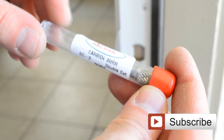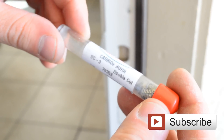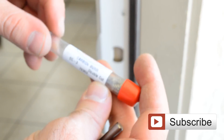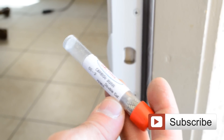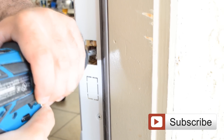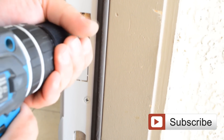Now we're going to use a small tool I bought at a local hardware store — they don't sell it at Home Depot. It's called a carbide double-cut and it's made to shave metals and wood. It lasts a really long time and I highly recommend it. If you don't have it, Home Depot sells alternatives too. We're going to use it to shave the metal edges so they won't be sharp, and also for adjustments — when we close the door we'll check if the bolt goes in and out smoothly without any interruption.